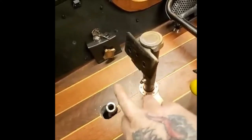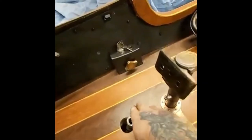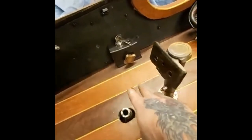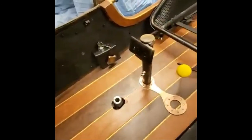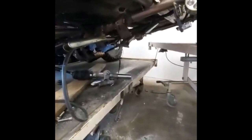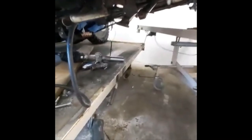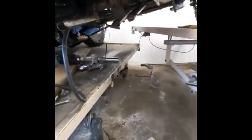The steering column will go back into its original position because I want the steering to work as it originally was. Luckily I don't have to take the floor out — I can manage all this with the floor in place, so there's a lot less work involved than I thought. So my job now is just to take this piece out, get the knuckle back, and reconnect the steering column. The bracketry for the steering rack is now all in and sorted — there's one back there, and a third one here where the welding clamp is.